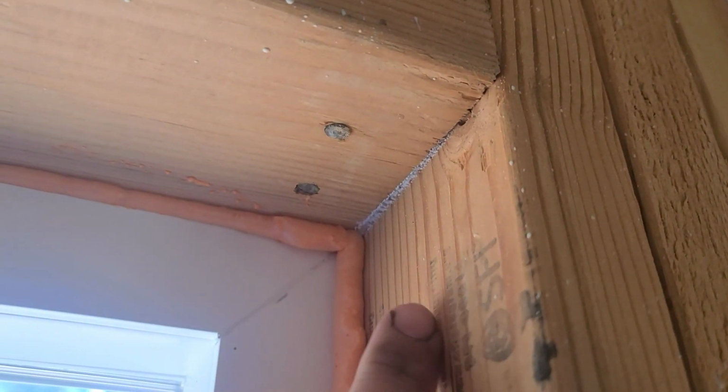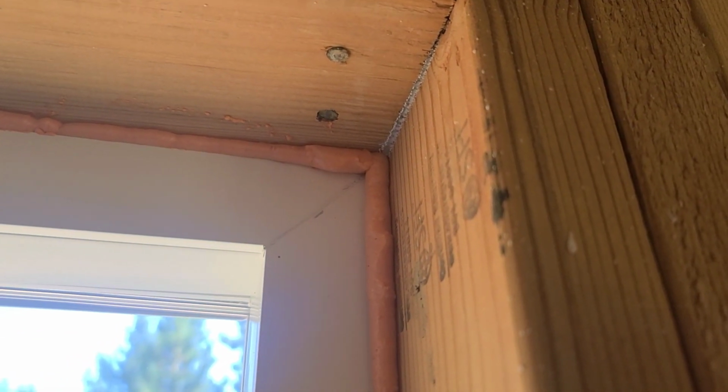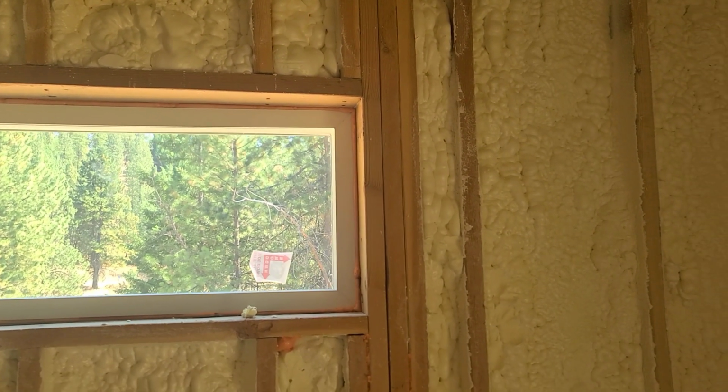They hand you a piece of paper that says this is how your house is. Check this out. Same thing. In the window, the 2x6 joint. You can see that's all AeroBarrier that went in there and sealed. No bugs, no air, just sealed tight. 0.5 ACH50 with windows and all that. And I haven't sheetrocked. I haven't done any of that other stuff. This is my building envelope. OSB, spray foam, AeroBarrier, done. Just do it.